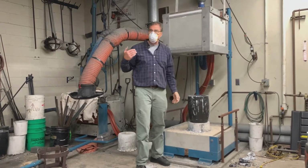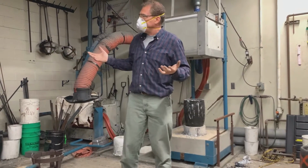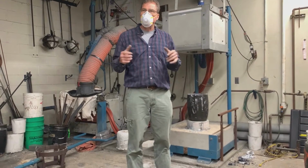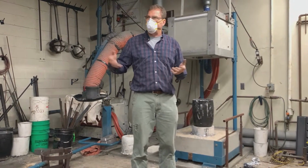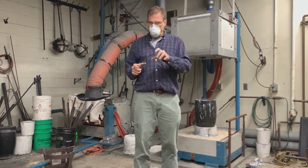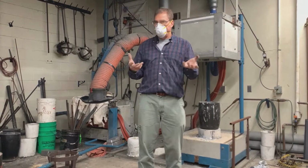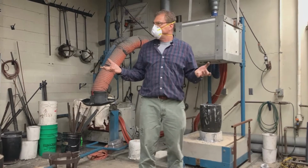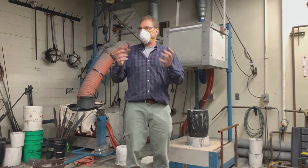So it's a magnetic field going through, you know, as far as I'm concerned, magic. It's resonating. Okay, so what's actually happening? Think about a transformer. If you took your intro to electronics class, a transformer has a coil, right? With 60 hertz. Remember, a transformer doesn't really work if you have DC, because you need to have that movement in order to change the flux going on.